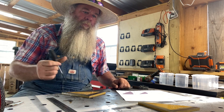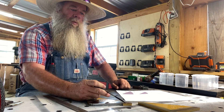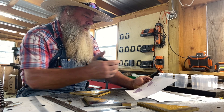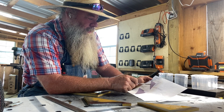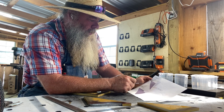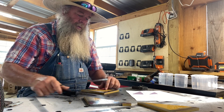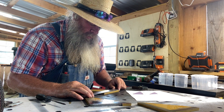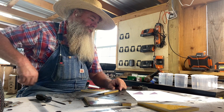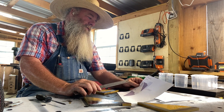Those two that we just cut actually go up underneath the back mold board, which is the piece of angle iron, and just the tip of them — six inches out in front — and this will be up underneath those quarter moon pieces. On these here, if we look at this diagram, it looks like those things are made a little different than what they sent me. We'll get lucky and not have too much trimming. On these, we need six inches wide to that line, and they're going to be four inches tall. So what we've got is actually six inches — we're not going to have to do near as much trimming as we thought.